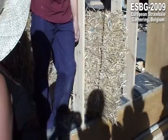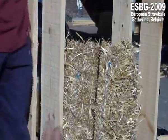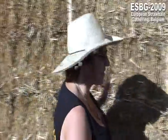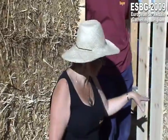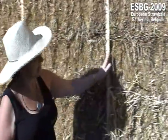Okay. So each second row you put the wood inside the other. So it's completely sunken in between. So with that you got less wood, less thermal bridges, and it's completely strong from one tip to another. You can try, but you can't feel it.